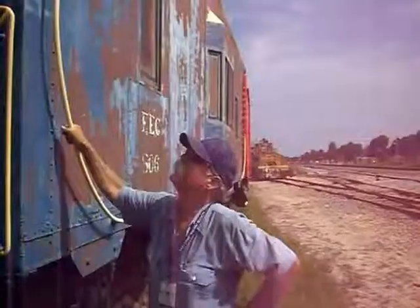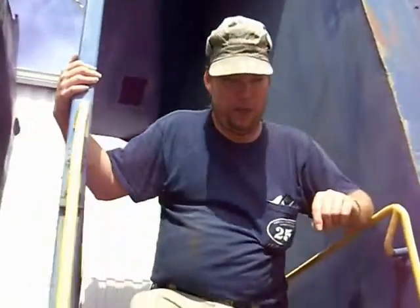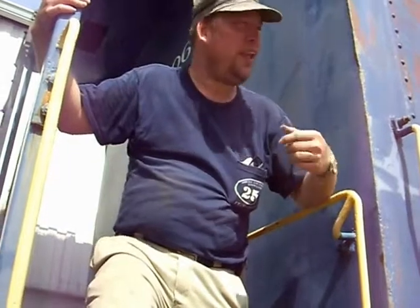The FRED is actually the flashing rear end device. Its primary purpose is not only to mark the end of the train with a flashing red light so following trains know where you are, but they also monitor the brake pressure. It has a small radio in it that will broadcast to the locomotive what its brake pressure is at the tail end of the train.